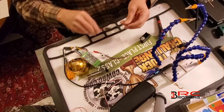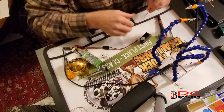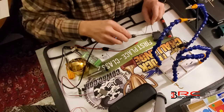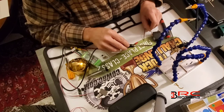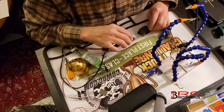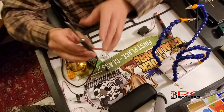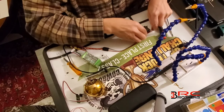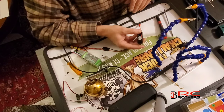Now we'll work on the back side. What we're gonna do is hook up a female JST right where the other wires came from. You notice the red dot — that is your positive. Make sure we got a little solder there, flip it around, positive side right here. Put that on there good and solid, and we'll do the other side, the negative side. There we are — you got the two wire ends on there, and we altered the top.